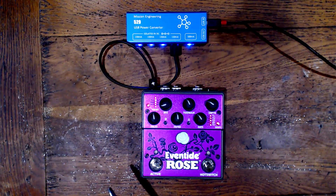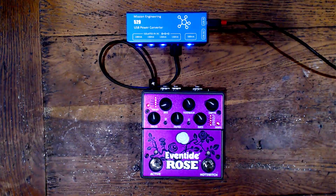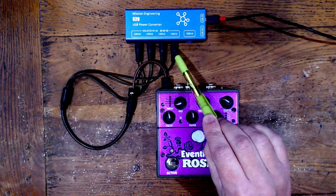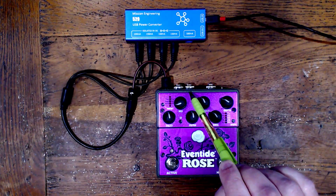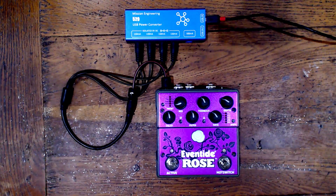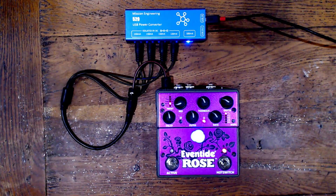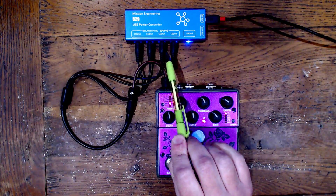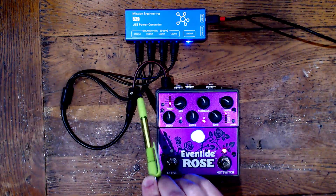What we can do is use the daisy chain or parallel cable and parallel together several of these 150 milliamp outputs, and that should give us enough. Here I'm using a four position daisy chain cable and I've connected four of these 150 milliamp outputs through the daisy chain cable to a single output connected to the power input on the digital pedal. Summing those together gives 600 milliamps, which is just a little bit over what we need. Let's plug it in — okay great, that's working fine, problem solved. The trade off is I'm now using four outputs from this power supply to power this one device, but if I have plenty of spare outputs and I'm trying to drive a high current device, using a simple daisy chain cable is one way to do it.